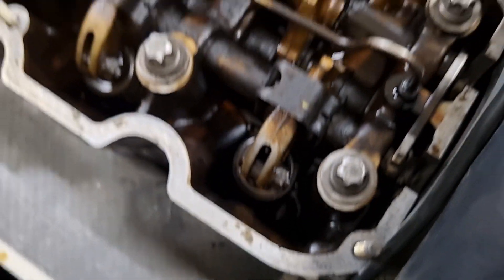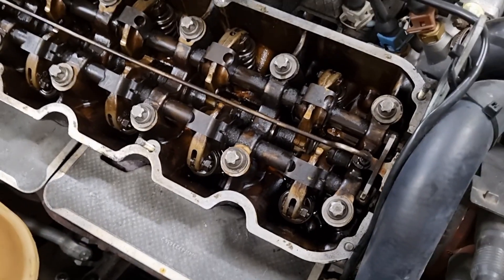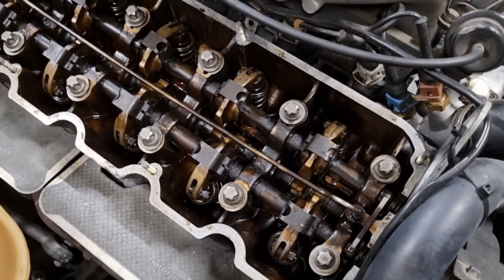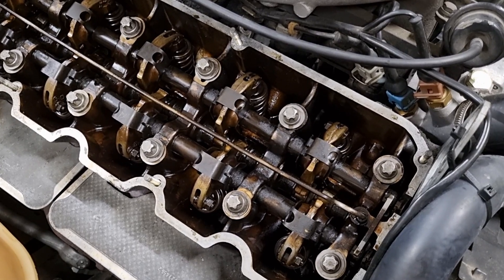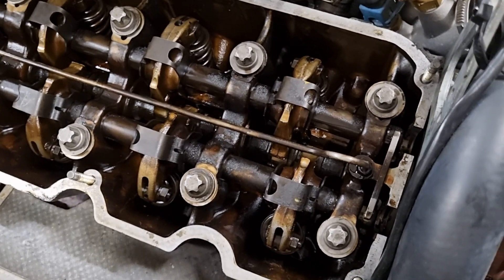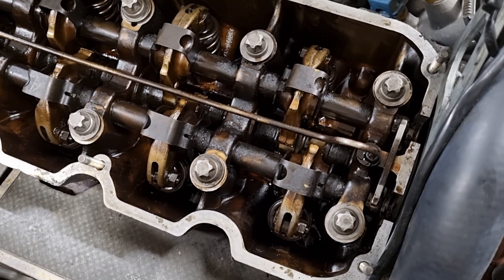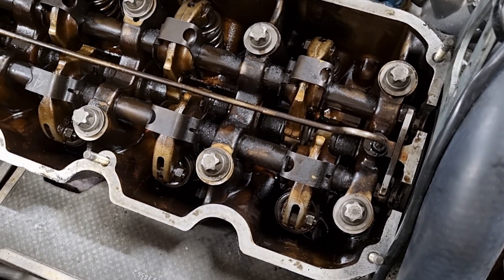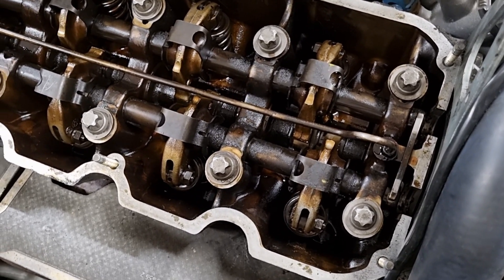You can't actually get a torque wrench in here. 10 Nm — if you think about it — that's one kilogram at one meter. So if your little wrench is only 10 to 15 centimeters, that's like eight or nine kilograms of force, or about 20 pounds, that you're applying with your hand at the end of a 10-centimeter (about four-inch) wrench.